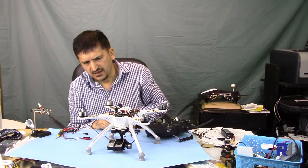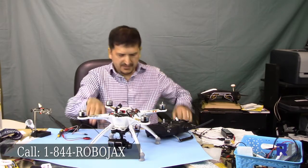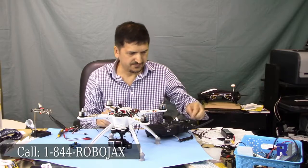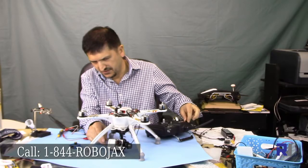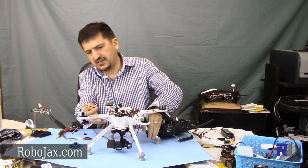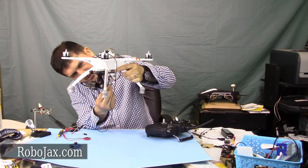I connected it and you saw the camera has some activity — it's now going up and down. You might not get the right angle and position right away. I put the knob at the middle and the camera is at the middle — that's very nice. I go left, it goes left. When I go from the middle to the right it should go down. At the maximum position the camera is almost flat, but if it's not properly flat at maximum, you can change it from here.